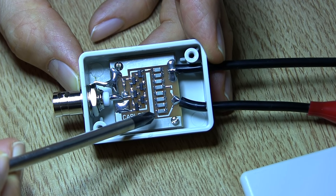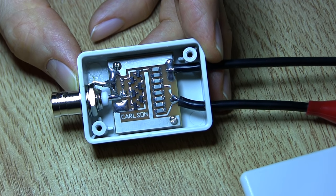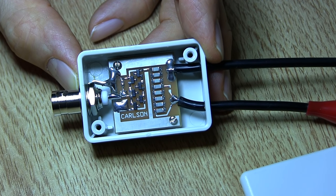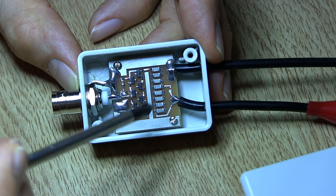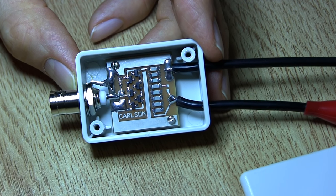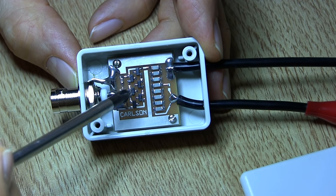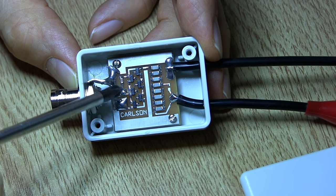You can see this trace is really close to the ground — a very small amount of area there. If something is going to arc over, I want it to arc at that point; I don't want anything to get up through this stack and reach the diodes. I estimate I could get to about 1500 volts before that gap would start to jump — a little extra protection. I don't plan on taking this above the 300 to 500 volt range anyway. This runs into the BAV99 diodes — six of them — that's the diode stack, and then a 0.01 capacitor runs to the center conductor of this BNC connector.